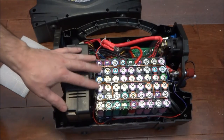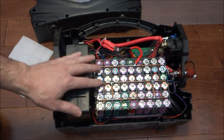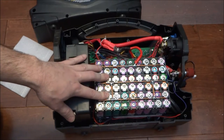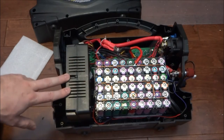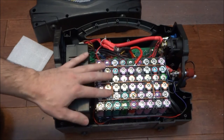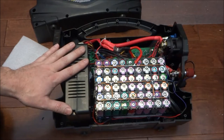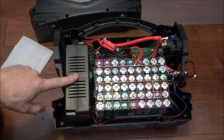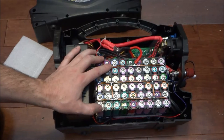Why did I go with three in series? Lithium-ion batteries fully charged are 4.2 volts, so three in series gives 12.6 volts. That'll work, but it's a little lower than a lead-acid battery which is usually 12.8 volts fully charged. If I went with four cells in series the voltage would be too high and the inverter would not run. I think the inverter shuts off at about 10 volts, and a fully discharged lithium-ion battery is about 3 volts — so 9 volts — meaning it'll shut off a little prematurely.